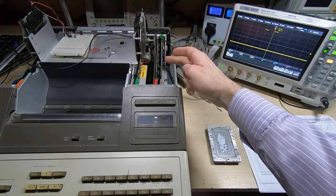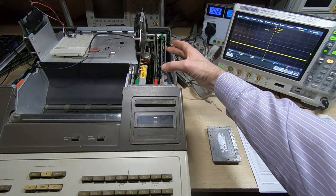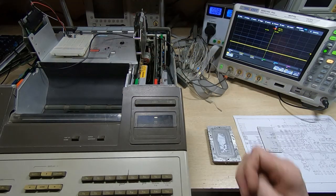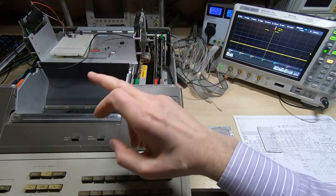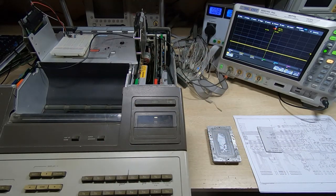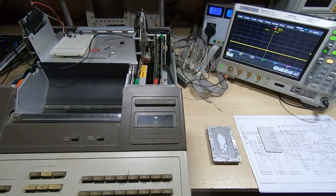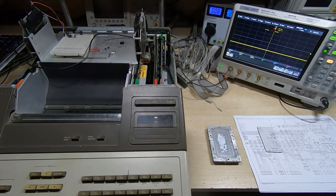Once off camera, I did the same thing with the PPU — attached the logic analyzer to it. There's an identical test connector with all the pins in the same order, so you can just unplug it from the LPU and plug it onto the PPU. We should get a similar type of action, except the PPU should identify itself as the PPU and branch to the block 5 code, which is the code at the beginning of its own RAM and ROM card.